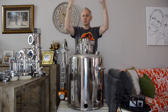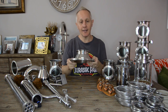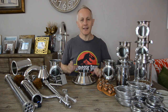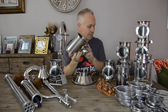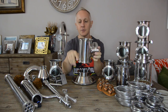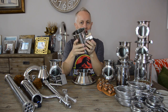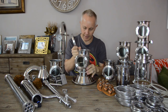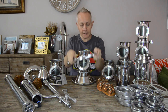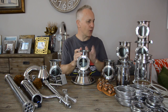From the 8-inch to 4-inch reducer, I'm back at the table to talk through all the components. From the 4-inch, I like to use my different T-sections. All of them are exactly the same — 4-inch diameter with 6-inch height and a 4-inch side glass that you can remove and clean. They all just sit right on top with a silicone seal at the bottom, connected with tri-clamps. Most of the time I don't use all 8 sections — I can make an 8-plate column, but typically I use between 4 to 6 depending on the configuration I want to run.